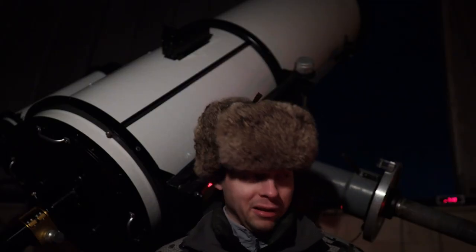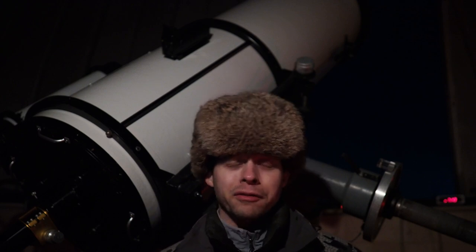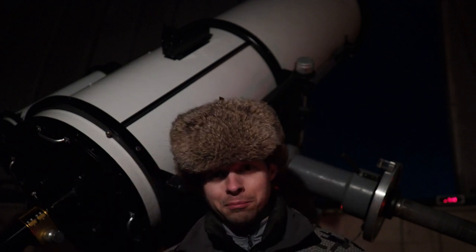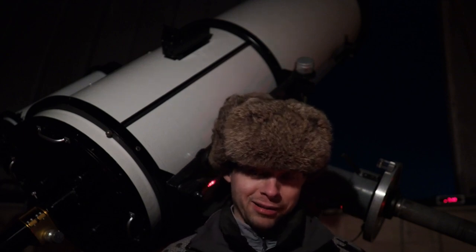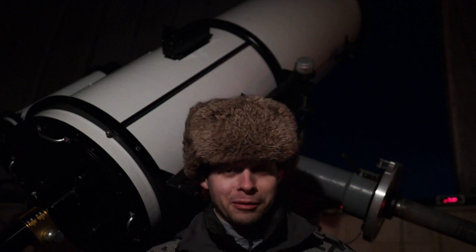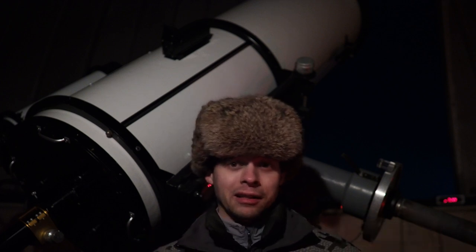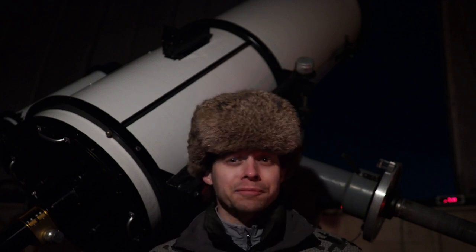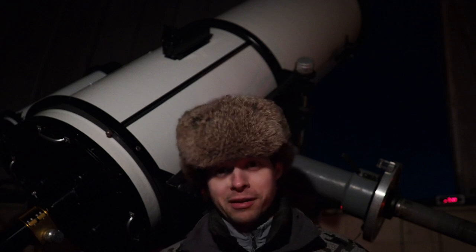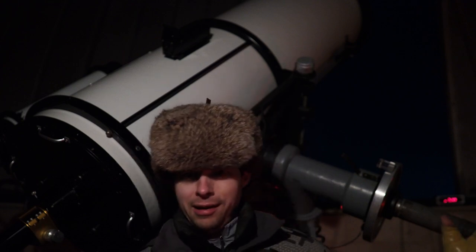Let me tell you a little about this scope. It's not the oldest scope at our observatory, but it's one of the older ones in the oldest building — erected in the 1950s. The actual tube of the scope is a big concrete form with about 30 coats of paint on it, so it's essentially a tube of enamel at this point. The mount — myself and a couple other members, with the whole observatory involved — we took the thing completely apart, totally rebuilt it, had the mirrors recoated and surfaced, and really tuned it up. It's a much more fun scope to use now.